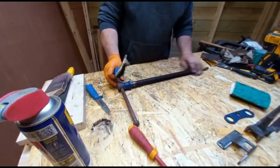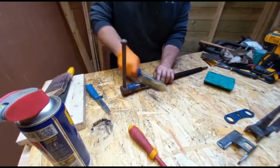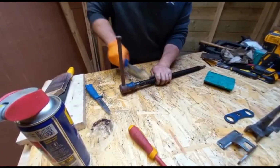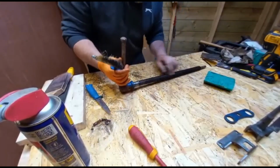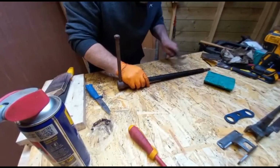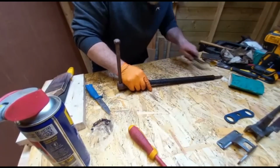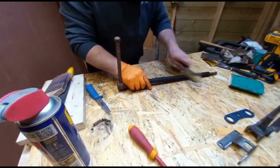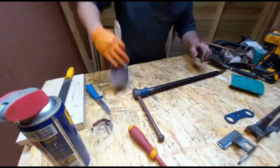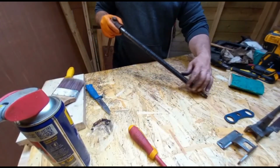It's not that it would wear or that you would do any damage with the paper, but because it is steel, it's just better to be safe than sorry and not get carried away rubbing a particular spot that you might see something that shouldn't be there. And that's when you'd end up wearing the top off a thread or flattening down a thread. The last thing you want to do is to ruin the screw which makes the vise work, especially when it's in perfect nick. I mean, the teeth are sharp.